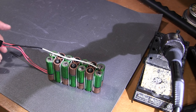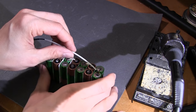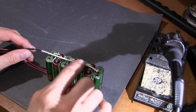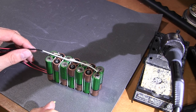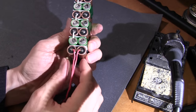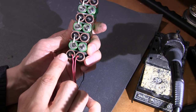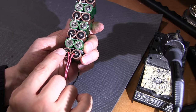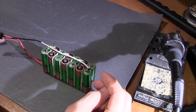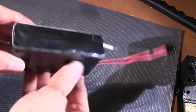Here's a quick look at the battery pack with the wiring harness on it just before I cover it all up. The negative lead is attached here and I have a piece of protective high-heat pipe over the wire as it runs across the batteries — this is the kind of fibrous stuff you find in toasters. On the top I've attached the two positive leads. There's not enough room to attach both leads to one battery so I split one off to each battery, joined by a little jumper in the center. Now I'm just going to cover this thing up and we'll try it out — here's the finished product, all wrapped, worked out quite nicely, nice solid build. This is ready to go into the oscilloscope.